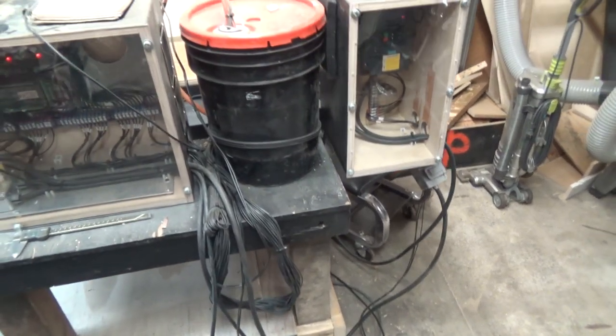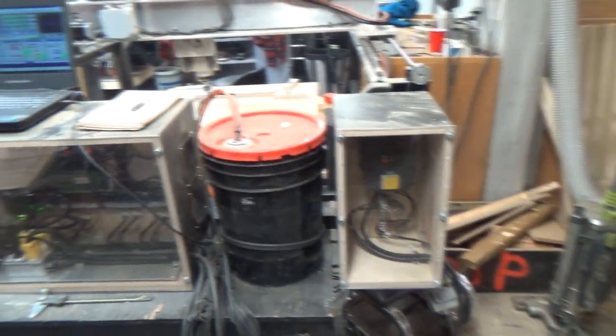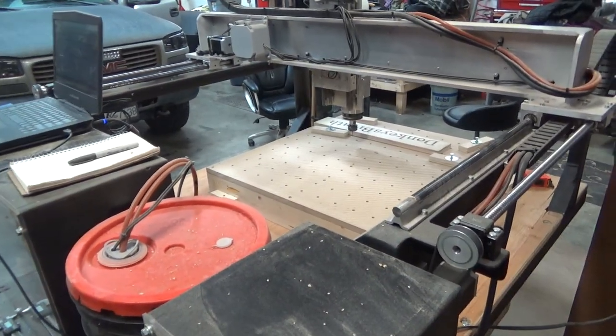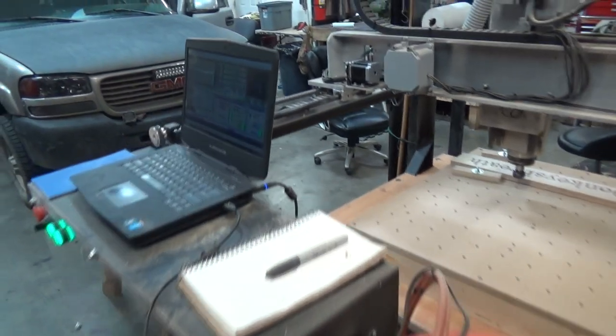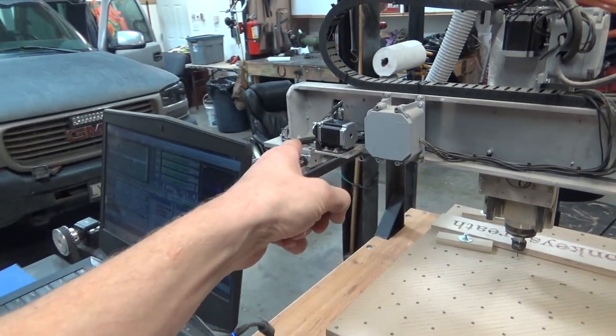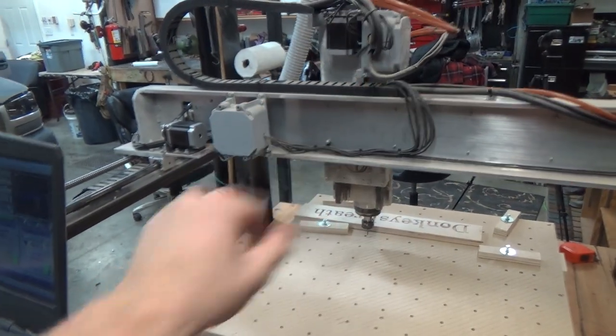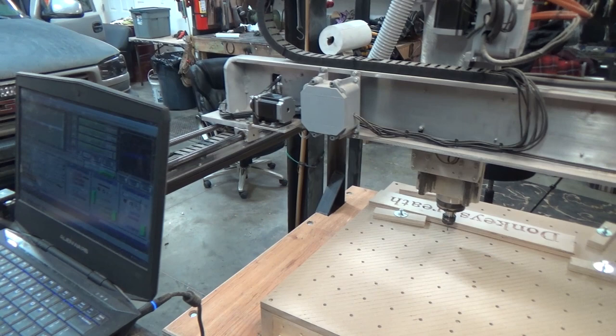I'm not really gonna play with this except for some cable management there in the end. But I really have to call this. It's been like 2.5 months since I started this video, and it's been probably a feature film. In the future, we're gonna be first upgrading that motor to just a bigger NEMA 23 because it has the heaviest load to move the head back and forth, I find, and it's roasty toasty.